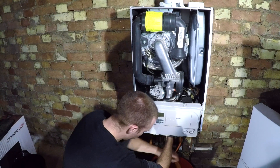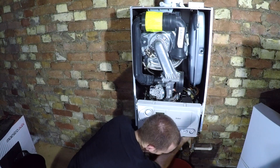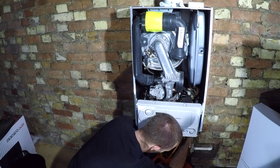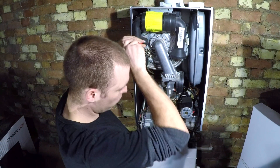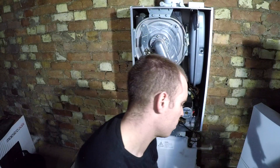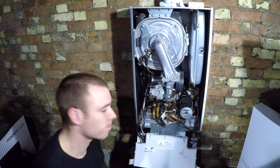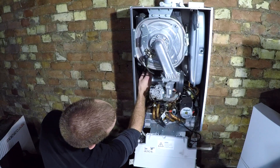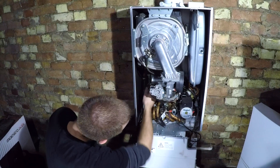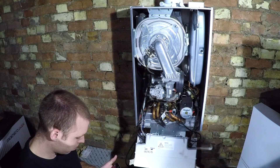Eight mil spanner - drain the boiler. The AAV is already sucking in air. Let that drain itself. I'm going to undo the NTC - this is the flow NTC - just squeeze it together and pop it off. I removed that trumpet for access and I'm going to film in here with my phone. Boiler is draining, you can hear the AAV sucking in air.